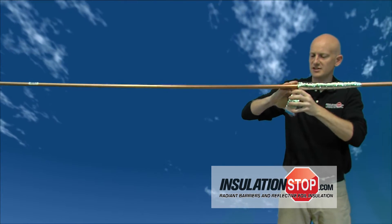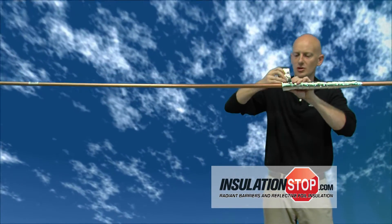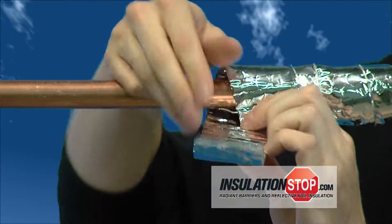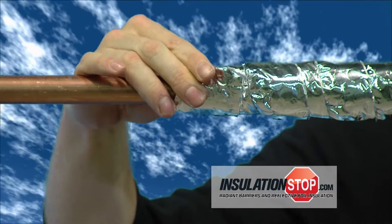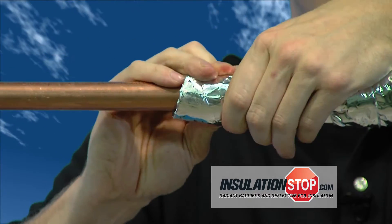The four and six inch spiral pipe wrap is used for larger width pipes and also for condensation on drain pipes. You'll start again with another eight foot or manageable length to complete the pipe wrap install. It's always nice to tape off wherever you start and stop — it makes installation a lot easier.